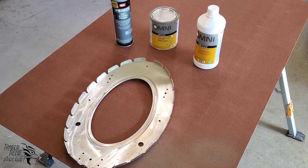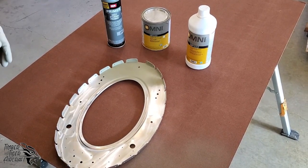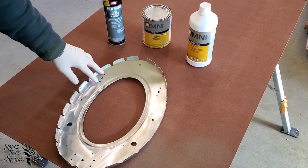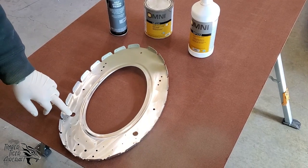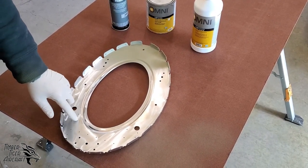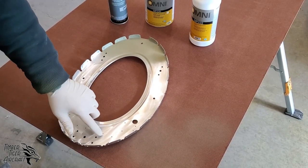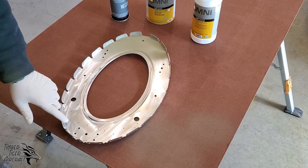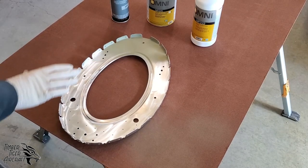This is the last bulkhead on the fuselage, on the STL fuselage. It carries your horizontal stabilizer brackets here, and we've got some rudder cable through holes. This is where your rudder cable or your rudder hinge attaches. And then on the inside of the airplane, this is where your tailwheel mount goes. And of course, the front side of the bulkhead is what we're looking at now.